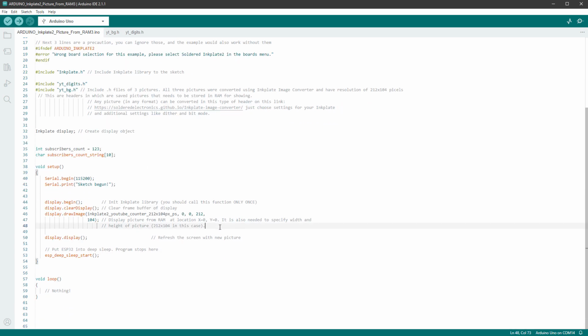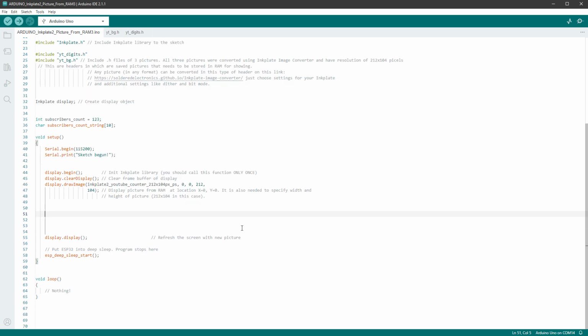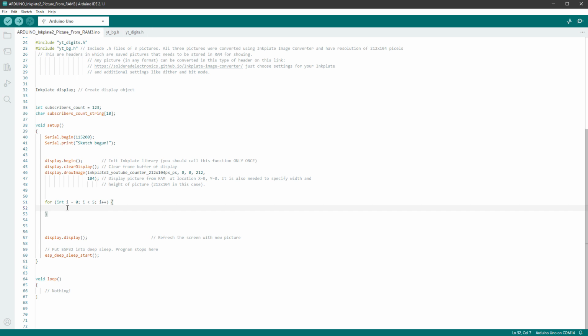Inside our main loop, we want to first draw the background image and then we want to draw every single digit. So I'll create a for loop for integer I equals 0. While the I is less than 5 because we'll have 5 different digits, I want to increase I by 1, and inside this loop we will draw those individual digits, but before we do that we will convert this integer to the string using the sprintf function, sprintf, and we want to convert it into the subscribers count string. We want to convert one integer which is a %d, and the integer name is subscribers count.